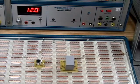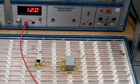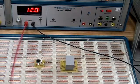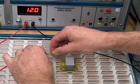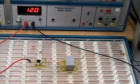Good common practice is to hook up the control relay's coil first. This way you can separate out the control circuit from the power circuit. So I'm going to hook up to my 12 volt power source here, and I'm going to run my positive to the common on my normally open push button. Then from there I will go from my normally open terminal to one side of my control relay's coil.